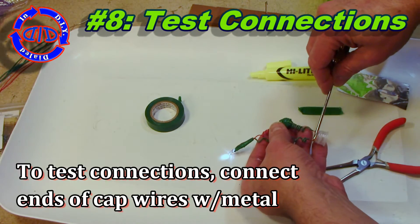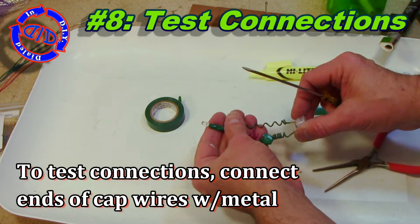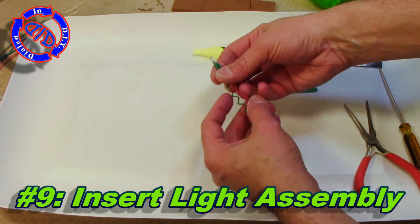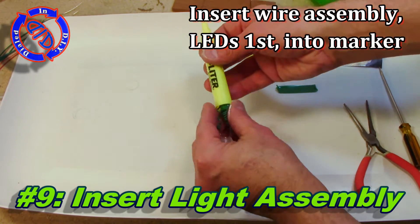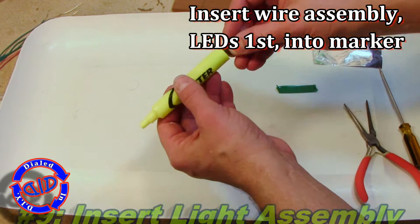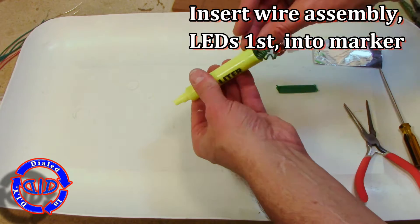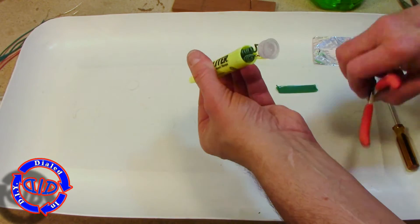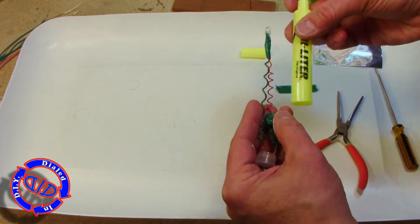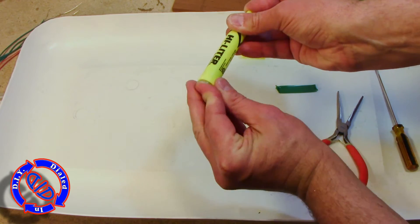Laying the positive lead wire across the positive side of the battery and the negative to the negative, we hold everything in place and then take a little bit more electrical tape and just wrap it firmly around there. The nice thing about electrical tape is you can stretch it a little bit, which gives it a nice snug fit. We can then go back and take the screwdriver and make a contact point between the two wires that go in that end cap and make sure that everything lights up. This is where you get to see why I like to use solid core wire for a project like this, because as you put this down inside the pen body, you want the wires to stay stiff and hold that LED pointed right at the open end of the body of the marker, so you can aim that LED right out the tip for the best bright shine.